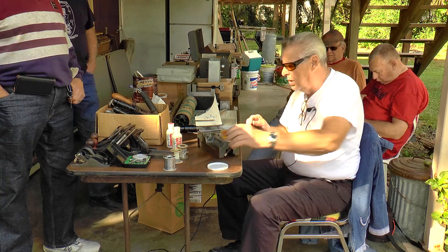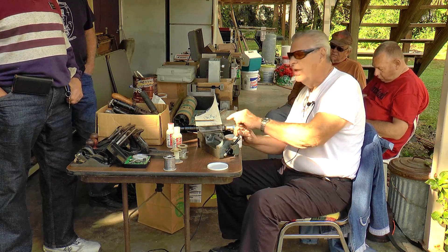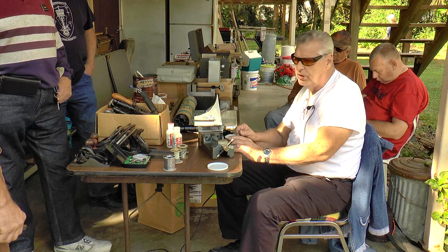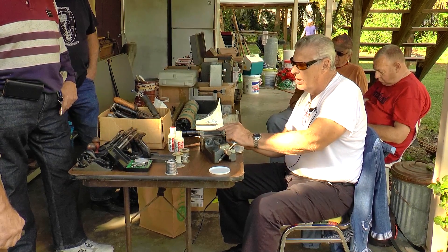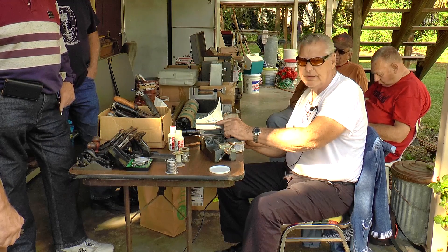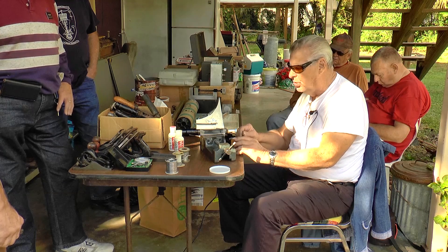We're putting a little acid flux on this first piece. We're soldering galvanized to galvanized. People think that's a no-no, but it's not. I've done it for years on my job all the time. After that, we're going to solder the galvanized to stainless steel. Then after that, we're going to solder the stainless steel to brass. Same flux, same solder, no change, no distortion.